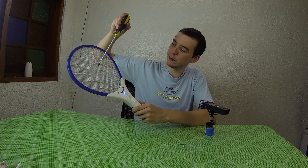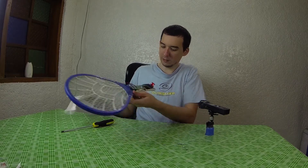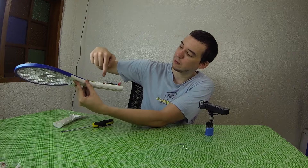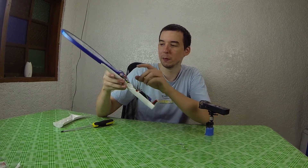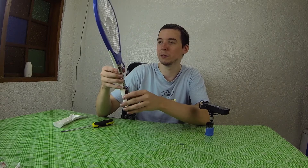So if I test this you can see it working. I'll open it up. Inside you'll see the battery, and hopefully you can see some large capacitors in there and of course the transformer. The transformer is the key here — that's what's stepping up our small voltage, which is probably around three to six volts, up to maybe one to three thousand volts. Not extremely high — high enough to zap a mosquito but it won't be that high.